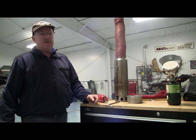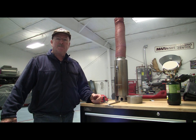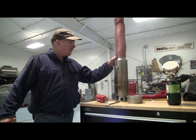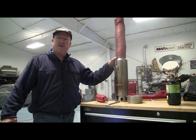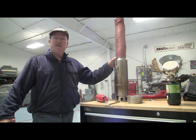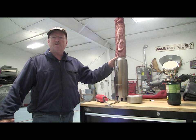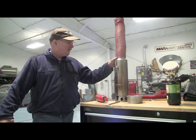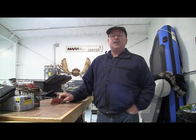The other type of heat system, and pretty much everybody uses this day and age, is an internal heat system, an electric heat system. I have two heat systems in the airplane. I have an internal heat system, and then I carry a backup system in case the internal heat system fails. So the internal heat system is comprised of a heat system on the engine, and then an electrical source to power it. If you've got electrical power, plug in 110 volts, so that solves the problem. If you don't, you need a generator, you've got to carry a generator. And so I'll talk about that. An internal heat system, in my opinion, is the safest way to go, and I don't think there'd be any argument there.